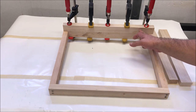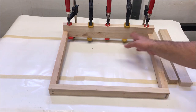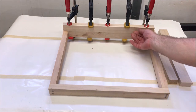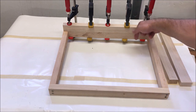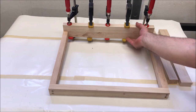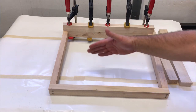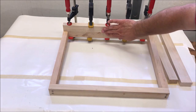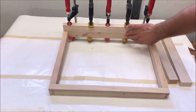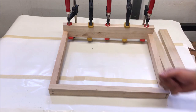My studs in my wall come to about here and here roughly, so I'll be able to drill a couple of holes in this bottom piece and attach it to the wall. I will also be drilling through here, maybe three to five holes, and putting some longer screws to pull these together. The glue should be enough to hold it, but since there is no brace out here, the entire weight of the turntable will be held by this back piece. I want to make sure that I firm it up as best as possible.